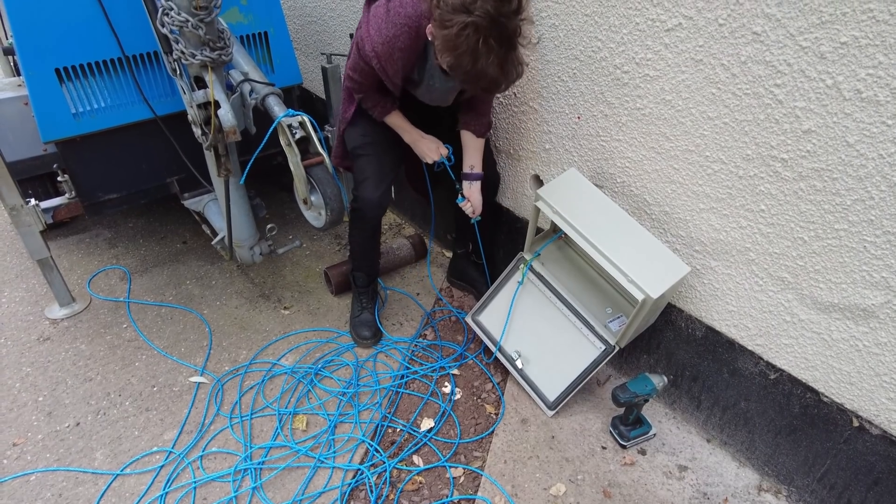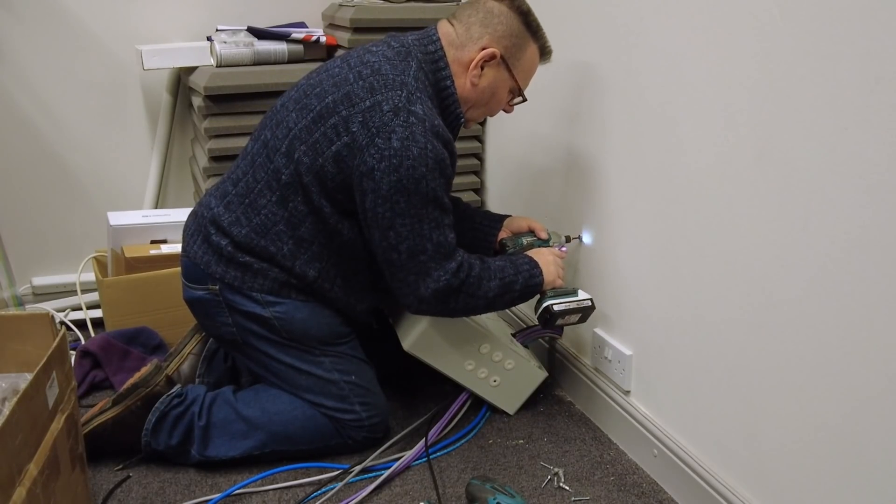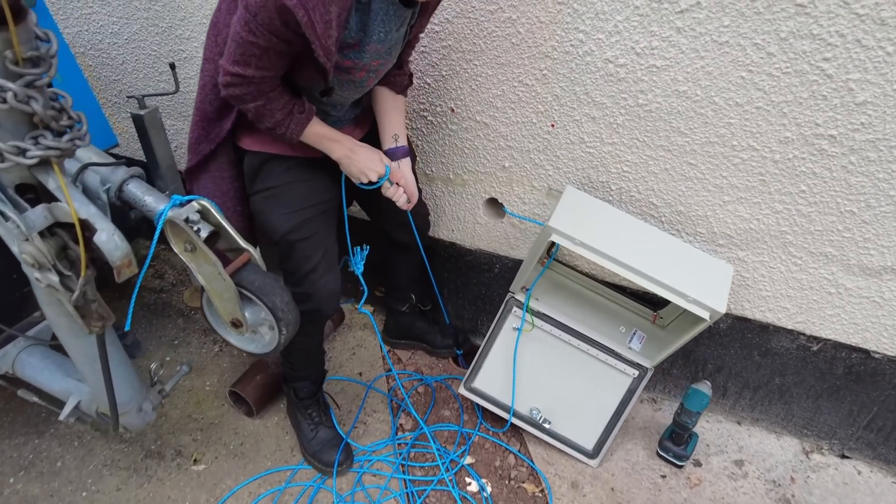New PL-259s fit like N-types and if you use them outside they're waterproof. When rearranging your shack, put in the biggest hole you think you need and then add a bit — I've got a two-inch hole and you can fit a lot of lines through it to the outside. Make it waterproof, and get the biggest outside box you can.